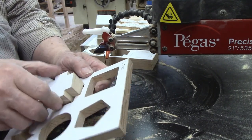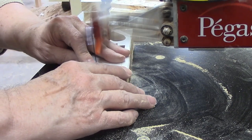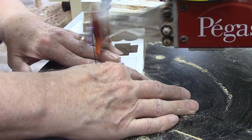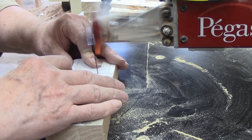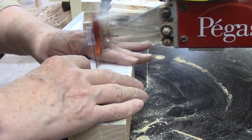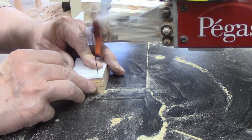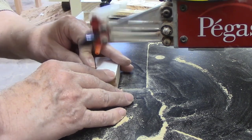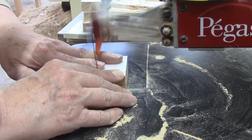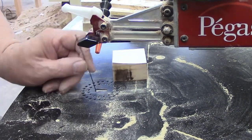The square was the next shape to make. I could have cut it the same way as the plus sign, but I'll show an easier way to make 90-degree corners. Since the parts are laid out on a narrow strip and they are only one inch wide, two sides of the square are close to the edge of the stock. I started cutting at one side of the workpiece and cut a line all the way across, then made the same cut on the parallel side. Rather than having to make a 90-degree turn while cutting, I was able to make the last two cuts as straight lines from one side of the board to another. This option isn't always available, but when it is, you can take advantage of it.